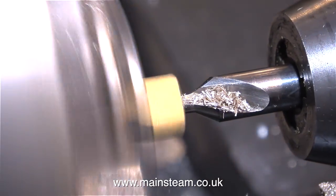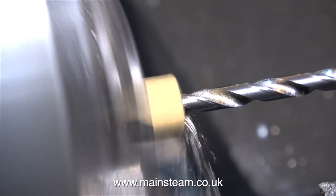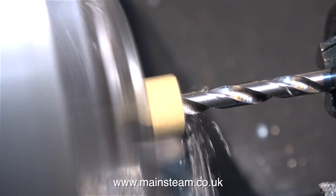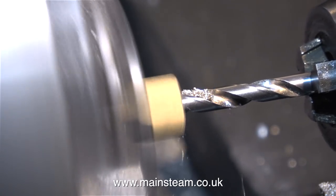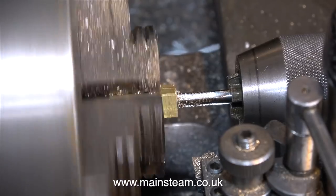But first of all, I need to make a suitable manifold that will accept three pipes from the steam outlets from the engines and combine these three steam outlets into one to connect to the condenser. It would have been easy to make both of these manifolds, the one from the boiler and the one to the condenser, identical. That way I would not have had to use some more footage or narrate it, but this one's going to be different.